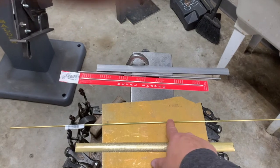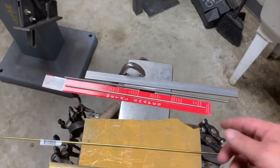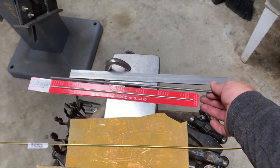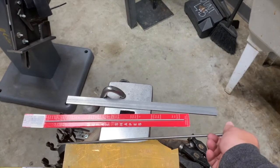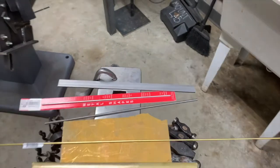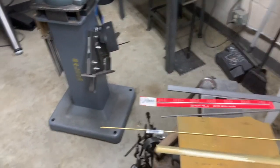The 260 you can cold form. The 360 you have to anneal before you want to start shaping it around an object — you can cold form it slightly, but it will crack over time. This is 302 stainless; I also use 316 stainless, but most of the time I TIG weld that material. This is mild steel — cold roll steel — and I use this when I braze and solder with cold roll stock, what they call strap material. Hot roll steel is also used in mount making, but that's more for welding — it has mill scale on the top, so there's just more to remove.